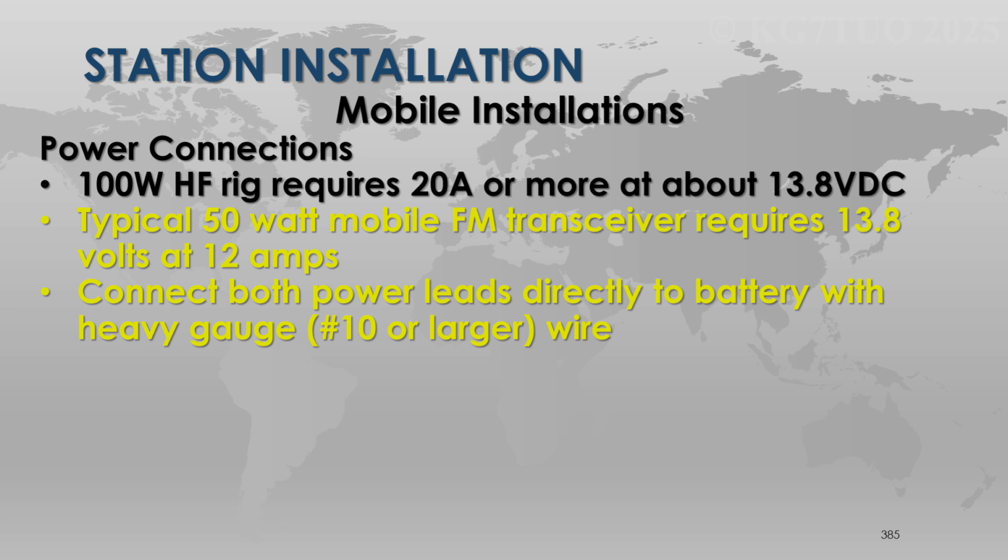Okay, number 10. Now that's not 10, what do they call it? 10 gauge style, off of Amazon. If it says 10 style, or 10 anything other than AWG, it's automatically suspect. Don't buy it unless you can read down in the reviews that a ham radio operator is recommending it. There are other choices. Okay? Don't buy the junk.